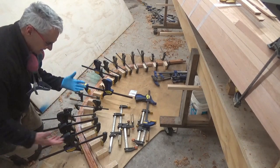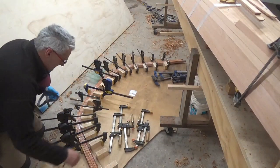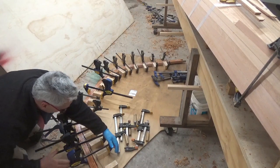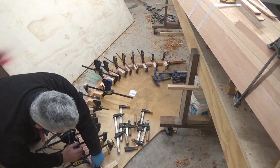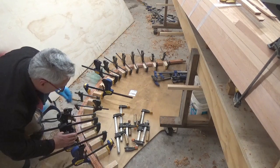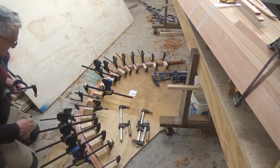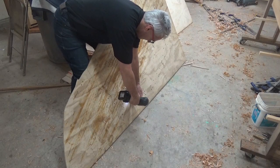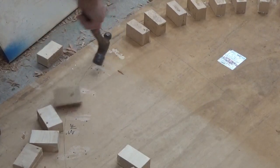The trick here is to not get epoxy all over the clamps — it's sort of a one-handed operation. The worst thing is grabbing the bar of a clamp so that next time you go to use it, the thing won't slide. I think that's all we have time for this week building the Elfin. Next episode we'll get on to cutting out some frames and setting up a strong back and aligning everything up. Thank you very much for watching — see you next time.